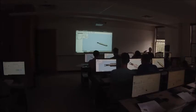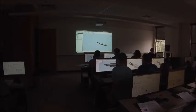But we can allow the clevis to move in and out by itself without the rod of the air cylinder moving, and that'll simulate what we want. It'll look a little weird, but it'll be functionally the same as what will actually happen on the real air cylinder. However, our mate prevents that from moving. If I suppress the mate, temporarily get rid of it, I can move it way out here. In reality, it's only going to move 4 inches.